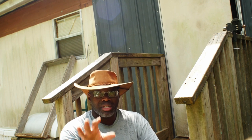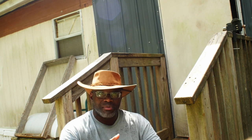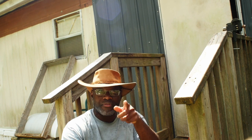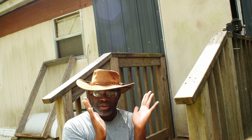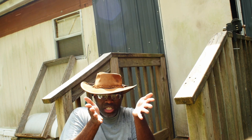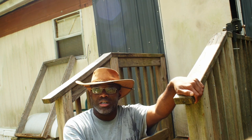But since I'm building this not from a set of plans, but from just up here, and if you're interested in the plans, they're on my Teachable page. I've done a little bit of work, then I'll take a long break and think about what I'm doing before the next major step. Like right now, it took me a long time to figure out exactly how I was going to do support ribs, because there comes a point where the boat has to transition from the angle here to a straight up angle here. And how do I make that transition where the wood is going to have to bend this way and twist a little? To what degree? Well, we won't know that ultimately until you assemble it.